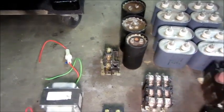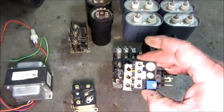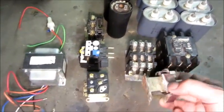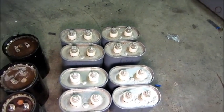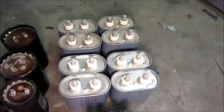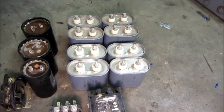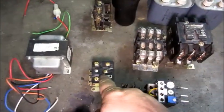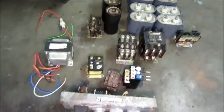This contactor can be used to engage these capacitors. I have two here for the main input and output — either one can be used, they're just different models, both of them are good. This is the motor overload relay — it's like a circuit breaker; if too many amps flow through the winding of the motor it'll turn the system off. The control relay will work with this button station for start/stop — control relay, overload, and button station work together. These two groups of capacitors: one group is the run caps that'll always be connected to the motor to help raise the voltage on the B phase or the drive phase, and the second set is boost capacitors that will be added in as necessary if the voltage dips a little bit due to a motor load being connected. It'll need a second potential relay to control the boost capacitors, and then this contactor switches them on and off. That's all the working parts of it.